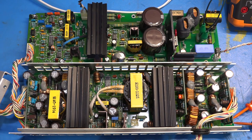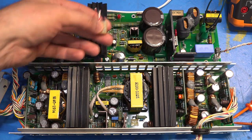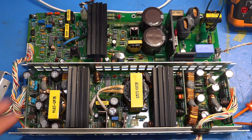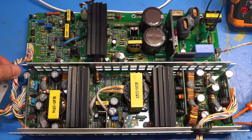Here's the power supply — it is fairly complex. It's got two main PCBs; this PCB sits on top of this one and the entire thing is in an enclosure. It's very difficult to work on it like this, so it's better to take it out and examine it. This is connected to an isolation transformer. We're not going to dig into every single step because most likely the primary switcher isn't even working. The front end has some protection and power factor correction circuitry, some rectifier, the main capacitors, and then our first switcher over here. All the outputs are on this other board, which does further switching to create all the different power supplies.